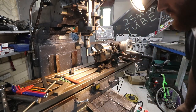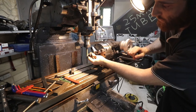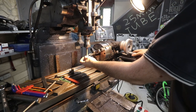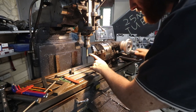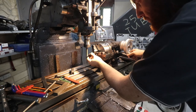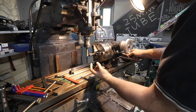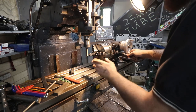Cool, hopefully that is right. Because there was that one in the middle where I screwed up, like the very first cut was a bit too deep. There's gonna be one weird tooth in it, but to be honest, I'm not expecting this to fit first try, because this, as accurate as I could eye it to grind it, it's not gonna be bang on. So we'll put this in the lathe, clean the burrs off it, and then line it up with the gear. And I'm sure we'll have to work out, once I see how it meshes, it has to go a bit closer, a bit further. Normally in a gear system, you want some adjustment between the gears, but the way the RC car is designed, the gears have to be bang on.